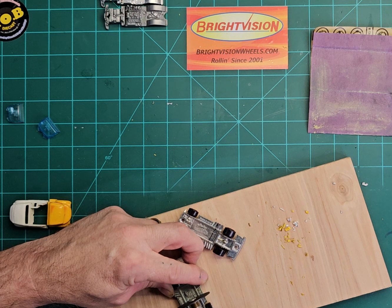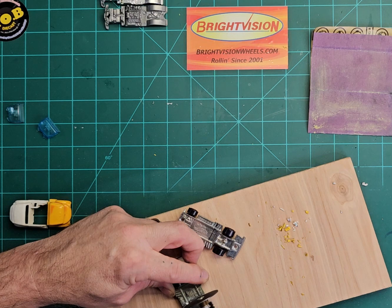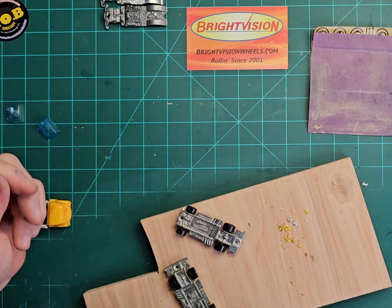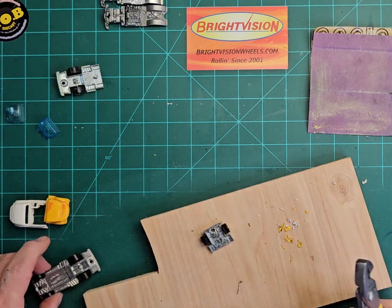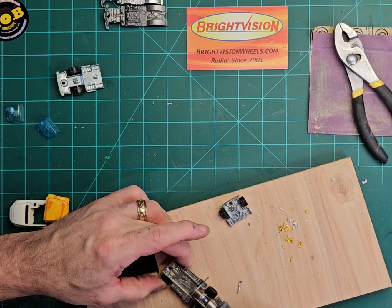Okay, you see here, I'm getting ready to cut this with the Dremel. Make sure you have safety glasses on when you're doing this. These discs are really easy to break. A lot of people use a Dremel saw to do this, or some people try to use a jeweler's saw, which is really nice if you're really proficient with them. Otherwise, it can come out really bad. So keep that in mind. But I find a Dremel, maybe a grinding tool, and I use a file and sandpaper just to get it flat, and you'll see me do all that here.